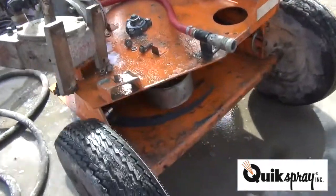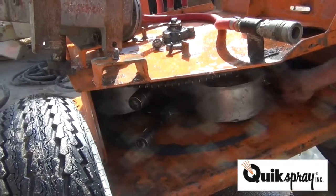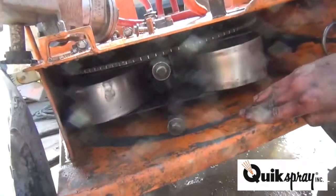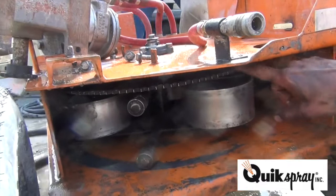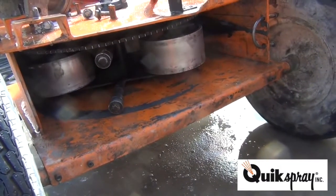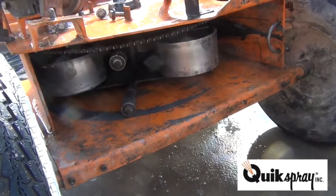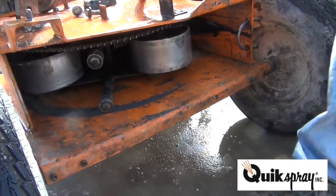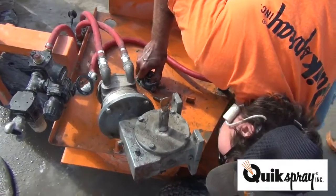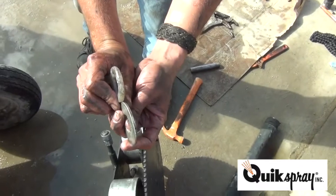Guts in the pump. So now we can check the spacing. That's really close. We can raise it up. You see the distance in the top, how you can still see a little bit of shaft? Yep. I think we pull that steely out. Put that in there. So out it comes again. Eighth or so. Yeah. See the difference in the shims?